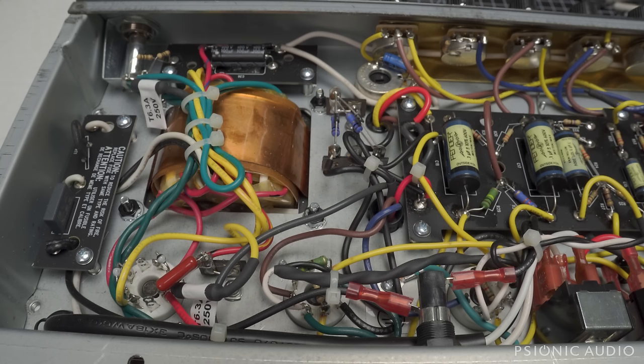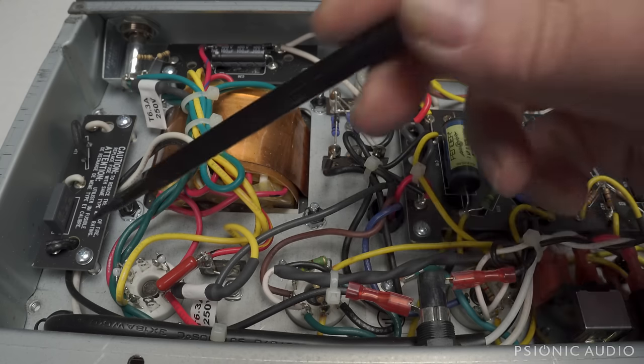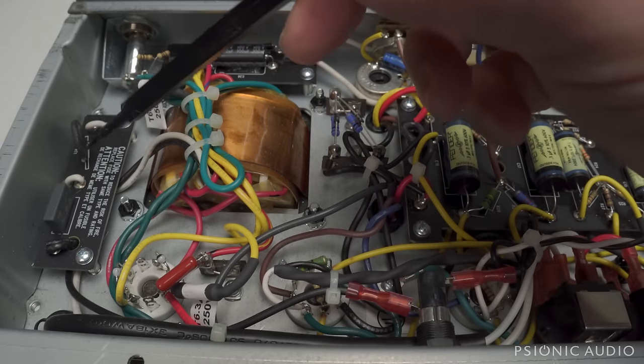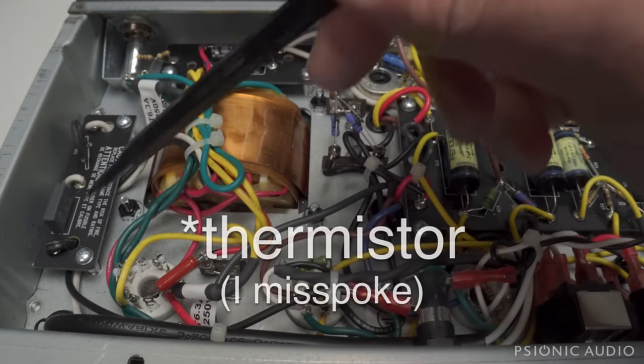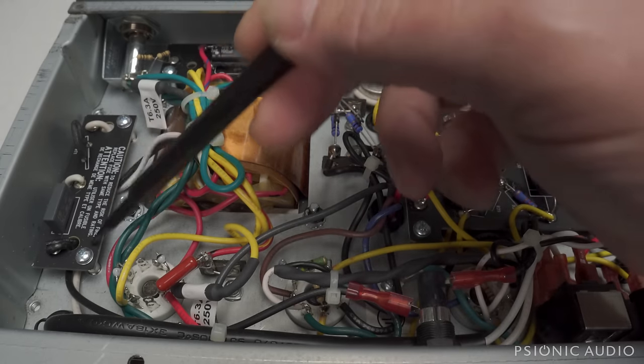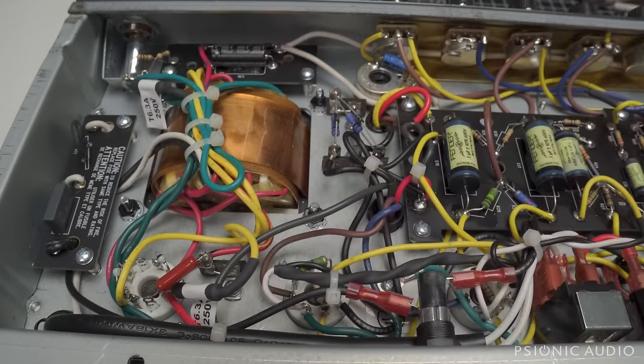All right, let's just go through this section by section. So the AC comes in. It's got this smoothing cap. It's got this varistor across it. Totally unnecessary. Does no harm, really, except it's one more thing to fail. The old ones didn't have it. This amp fairly arguably does not need it.